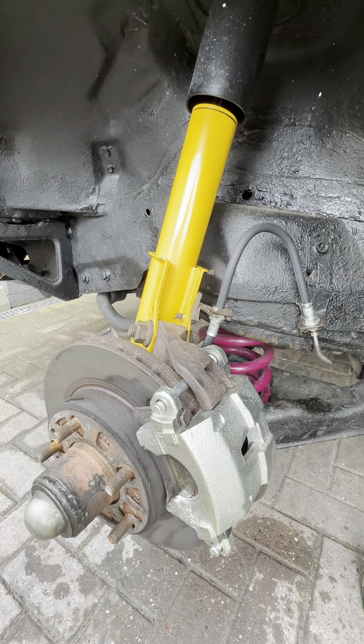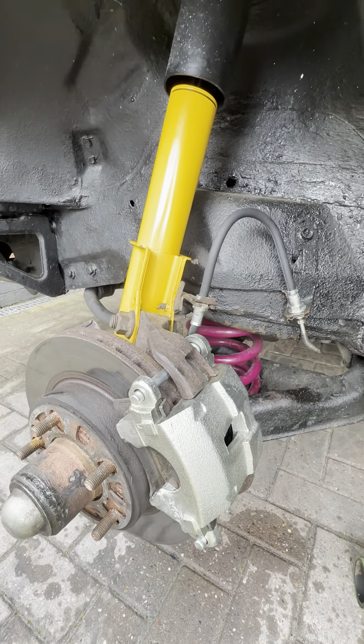First action was to get the car back safely and remove the brake caliper. We removed it, cleaned it all up, and really struggled to push the piston back all the way, so we thought maybe it was seized. Luckily we had a brand new brake caliper in stock, so we fitted that. After fitting the new caliper, we pumped the pedal and managed to get the brake to work — however, as soon as the brake was on, it wouldn't release.